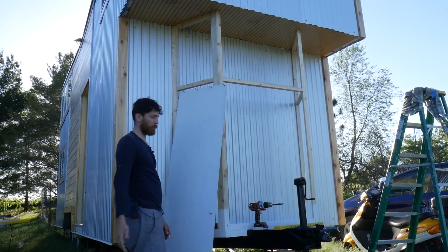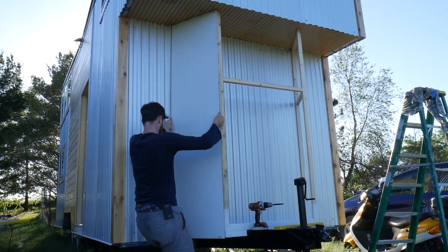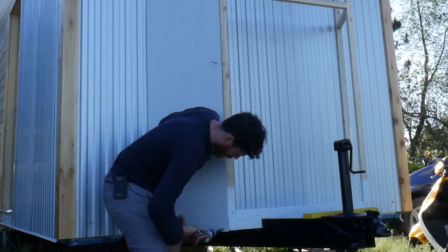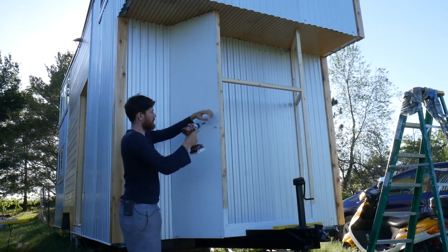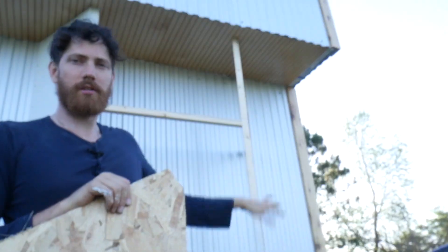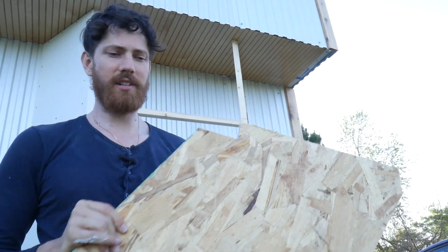I'm doing six-inch on-center screws just like I would with normal sheathing, and I've put a few in already to tack it up. Then I'll go and do the rest — and that's when your drill runs out of battery, always in moments like this. Swap the battery. Before I put that sideboard on I have to put in this crazy insert piece I cut, because if I put that side on first it'll be geometrically impossible to fit it in. These types of pieces never seem to fit right away, so I'll probably be hacking off eighths of an inch all over the place.